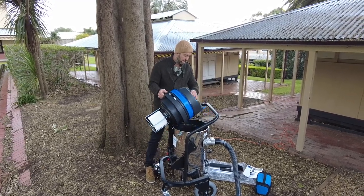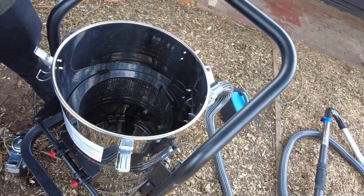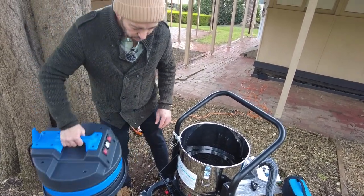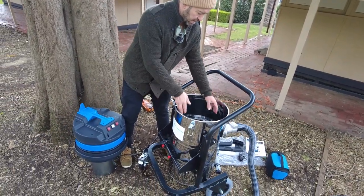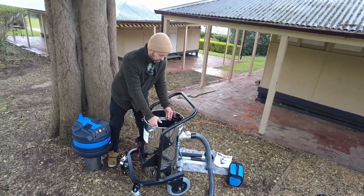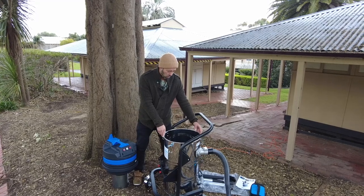The filter stays remarkably clean due to the way the system is built. Dirt enters through a side entry port at the front, gets a circular motion inside, and hits the deflector screen — so the filter itself stays very clean. The trolley has a sieve drain basket, so when pulling lots of leaf matter we can empty that basket into flexi containers.